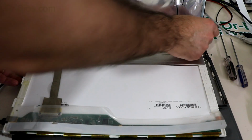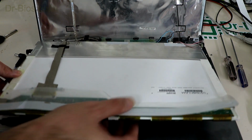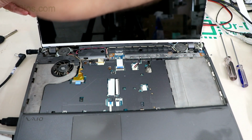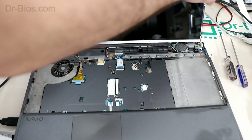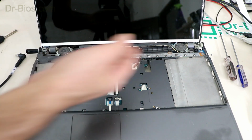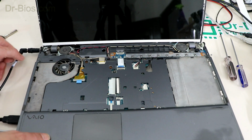There are two wires on backlight block. I'll connect one of them and don't use the other wire. So let me turn on the laptop and put the screen bezel front cover if it doesn't have any problem. And assemble it with tape. And hand it to the customer. I'll plug the laptop into power and see if the image problem is solved or not.